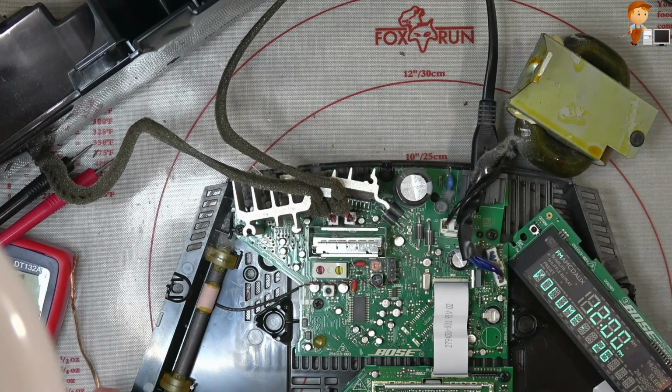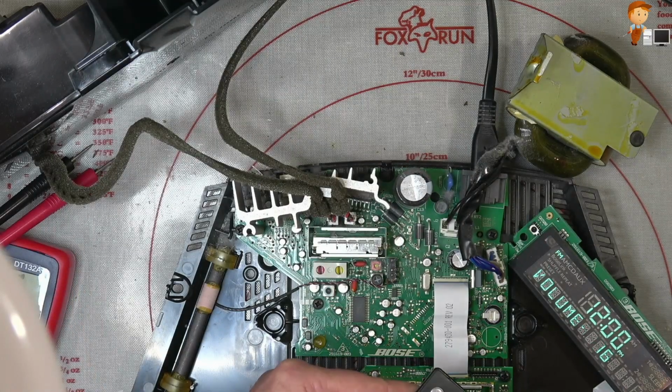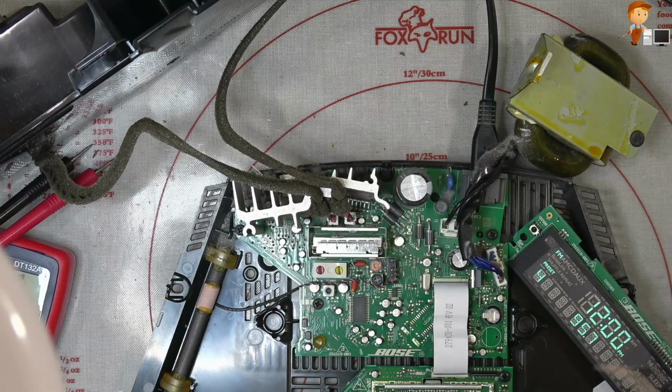So that slight thumping noise, I don't know whether that's because I don't have an antenna. It could also be these capacitors need to be changed. I am going to go through and change 1, 2, 3, 4 and then all of these guys here, because they will fail in the future, so preventative. But the main issue for no sound was that area there.